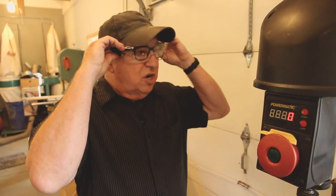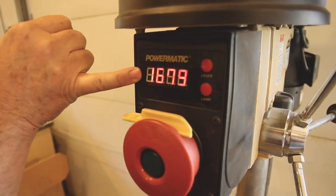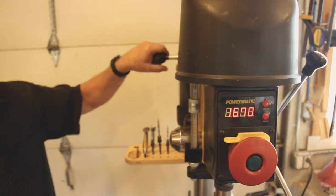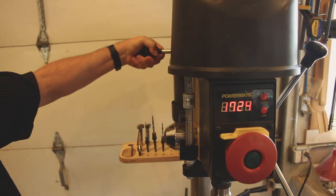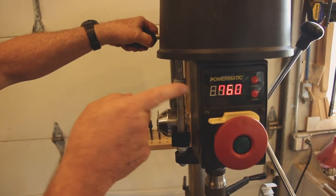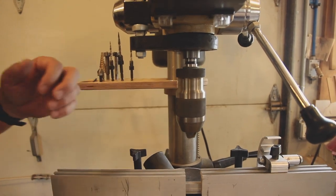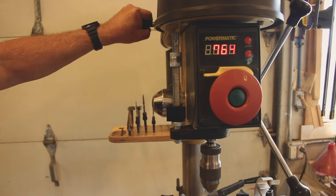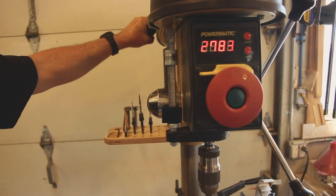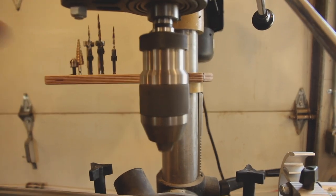Let's go ahead and demonstrate how this works. When we turn on the drill press, it indicates the RPMs — we're just below 1,700 RPM. To change the speed, you untighten the knob and pull it forward or backward. I'm going to slow it down. Pulling it forward, we've brought it down to about 760 RPM — you can see the spindle speed drop, you can almost see the rotation. Let's take it up to maximum. You can hear the pitch change — 3,000 RPM. Now look at the spindle: really blurred. The thing is really moving.